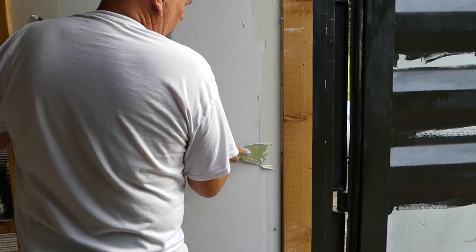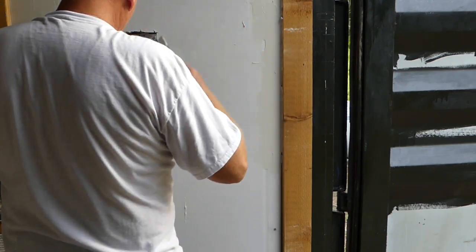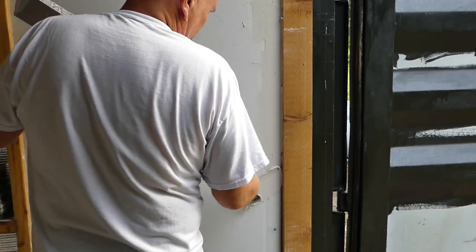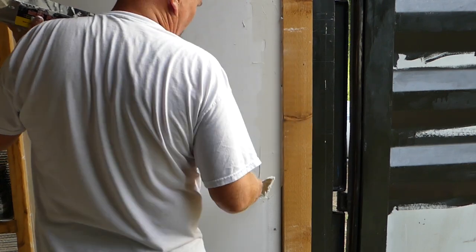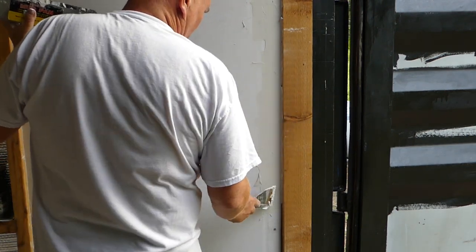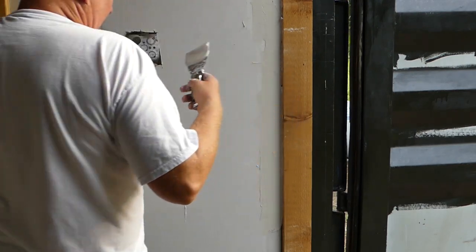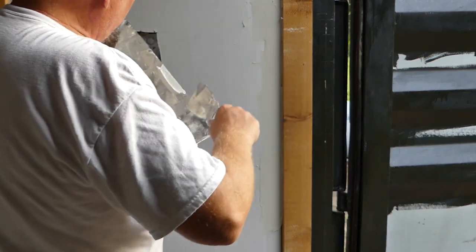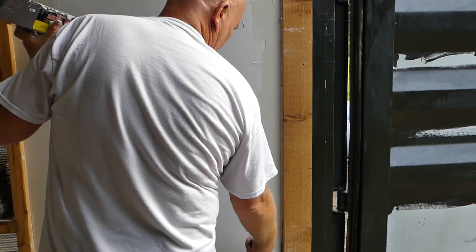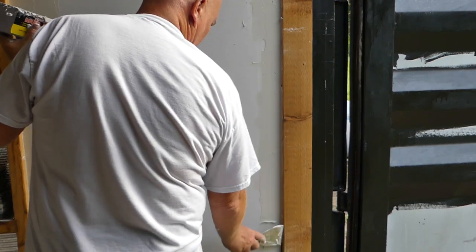My thought why I went with 12 foot sheets and cut them down to avoid the seams like I did is for a 1,000-year home, if there's no split in the drywall, I don't see ever getting a crack in the wall except along the post. And to be honest, if somebody comes back in and redoes the Italian marble or whatever, in my opinion, they probably can caulk. I'm not sure of that. But they probably can caulk.